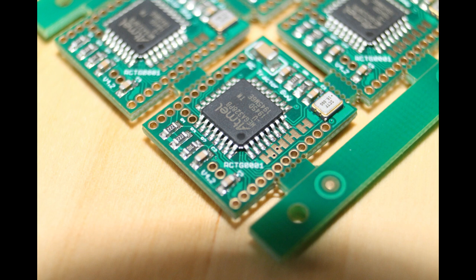Another big difference between this PCB and the old one is that we now have a row of jumpers just below the oscillator. What that means is we can just slice the thin trace of copper to separate that jumper, or alternatively if we want to rejoin it we just put a solder blob across it. This lets us change the configuration based on the chip. With the jumper connected it suits the ATmega 328P, because you need ground and VCC on those two pins, but if we cut it when using the ATmega 328PB we can use the two extra pins if needed.